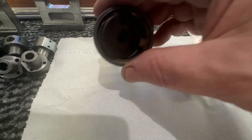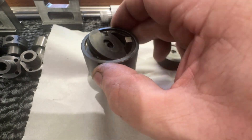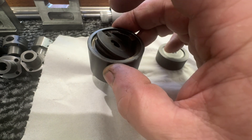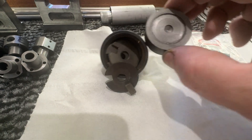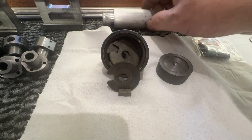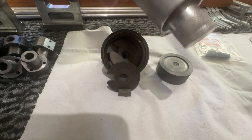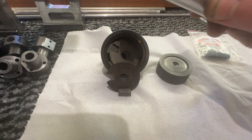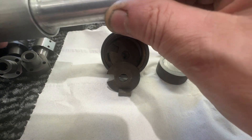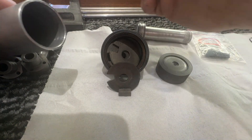Coming back to the Joe Higgins tooling — this is basically the little heating oven he shows for how to make piston rings. This is for doing the sides on a bit of emery cloth with a step in it, and this is basically for honing pistons. You can hear a bit of grit in there — the piston ring gets put on there and honed, and this is obviously the same diameter as the cylinder.